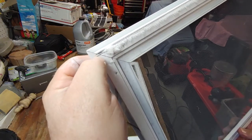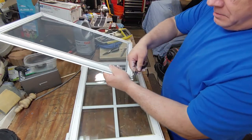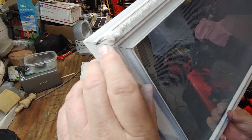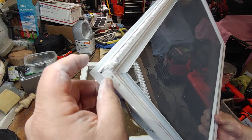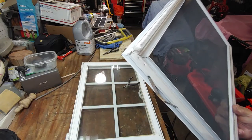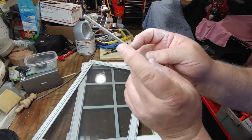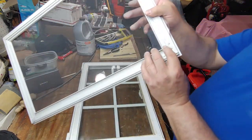You can see my cut now right here. I'm going to break this piece of aluminum out. Now you can see I have an opening to slide this weather strip right out. The file I'm going to use to file the edge down here because as you slide the weather stripping in, the sharp edge can cut the weather stripping as it goes in. It's just a regular metal file, nothing special about it. I'll file the edge here as well as on the opposing side.